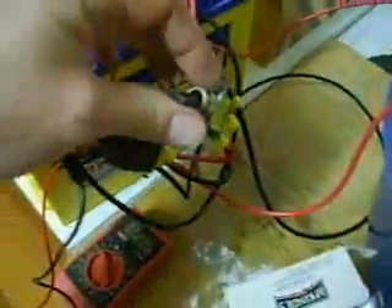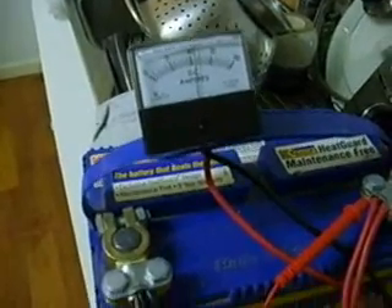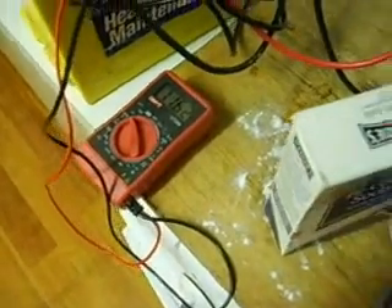I've just added some more electrolyte, so I'm going to try again. That's putting out quite a bit, and we're now running at about 11 amps, which is a tiny bit over what I was doing before, but close. Now we're running at 11.6 volts. I need to look back and compare this to how it was looking before, but I think this definitely justifies doing a bubble test as soon as I've got a container that's capable of doing it. So stay tuned.